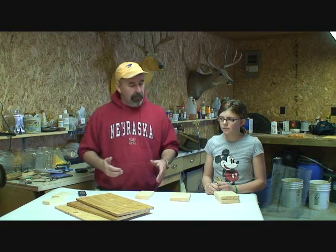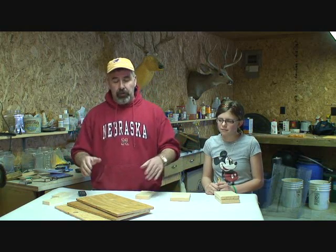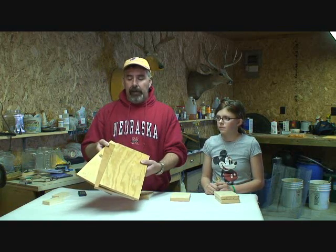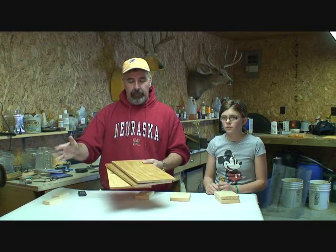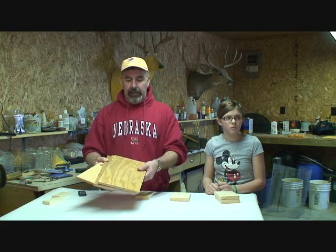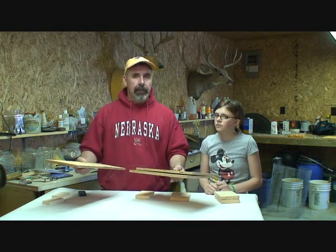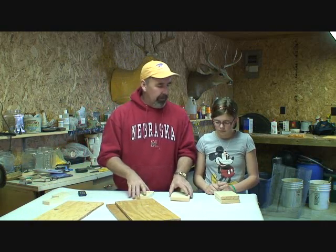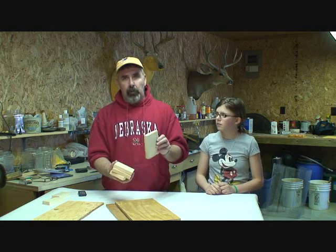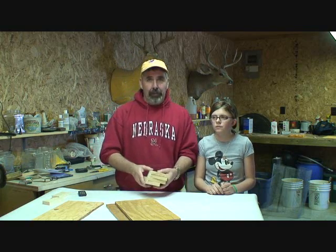Okay, I and the lovely Riley are back from the saw building to show you what we have cut here. These are all the parts you need to construct your sparrow trap. Now I have 3 pieces of 1/2 inch exterior grade plywood. You can use regular dimension lumber or whatever you have around the house. I just happen to have some exterior plywood, so I have 3 pieces that are 8 inches by 16 inches. We'll need 2 of those for the elevator and 1 for the back of the trap, you'll see as we start to put the trap together. We also need 4 pieces of regular scrap lumber, 3/4 inch lumber, that are 4 inches by 5 inches. So let's get started. We'll put this trap together.